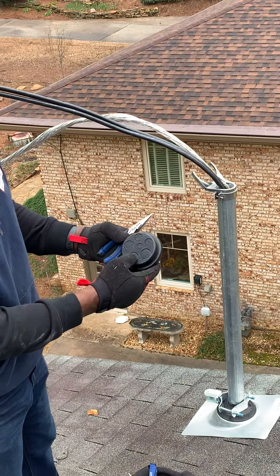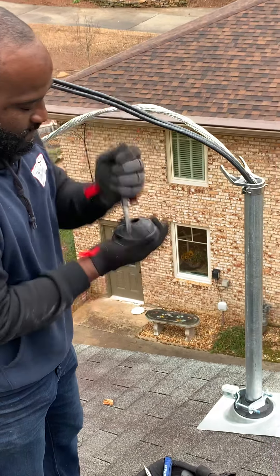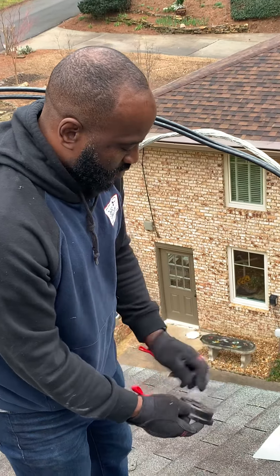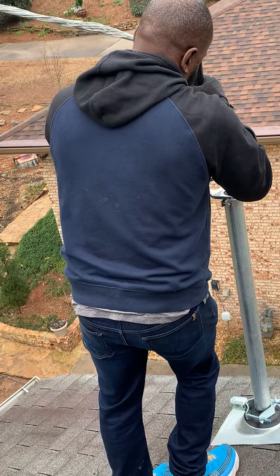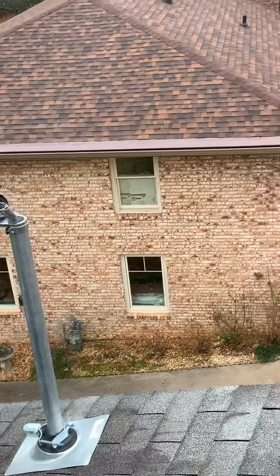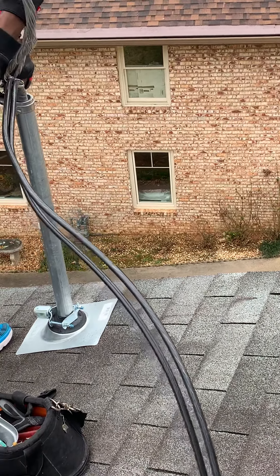You want to make sure you leave Georgia Power enough wire to work with — three feet is good enough, we probably got about four or five feet, more than enough. Just twisting this to make it tight. The existing wires already have insulation, but this one doesn't, so you're gonna have to kind of make it tight. This right here is called a weather head.